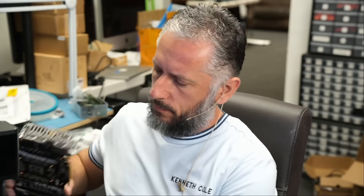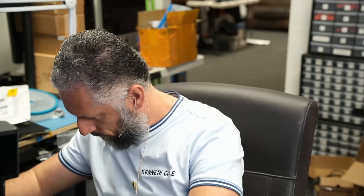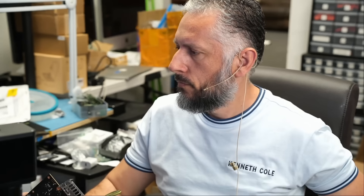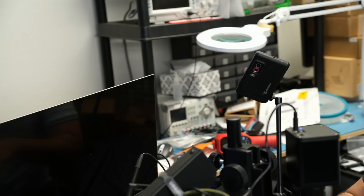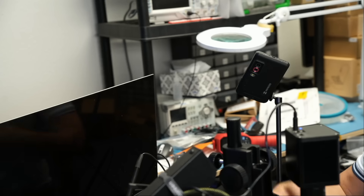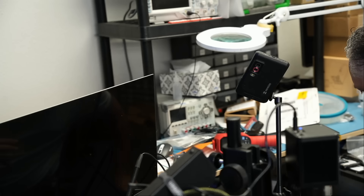Let's attempt to power the card without the chip. No six beeps! I'm looking at the screen — we don't have a logo but we don't have a heatsink on the video card and it is burning hot. That's good news. We no longer have six beeps, so that's the problem — that's 100% the problem.